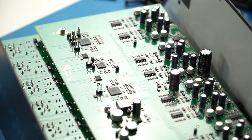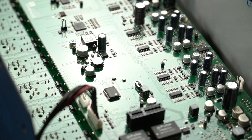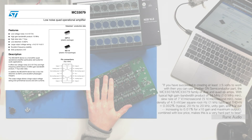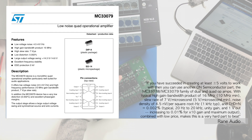I'm happy to report that these boxes include the same input circuitry as the StudioLive Series 3 mixers. Overall, I've been really impressed with how good this console and these stage boxes sound. PreSonus is using the 33079 four-channel op-amp in this design — four of them giving us 16 input channels — which is a low-noise four-channel op-amp from STMicroelectronics.